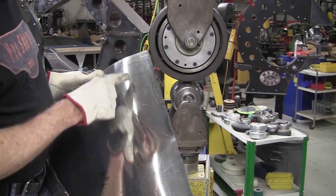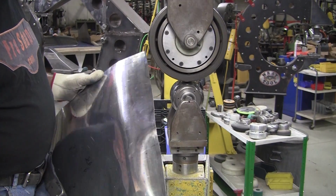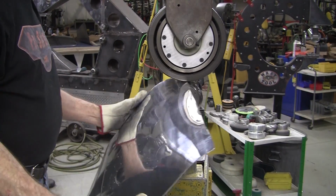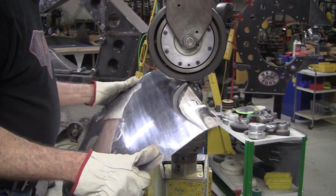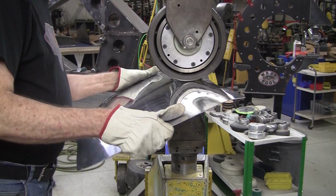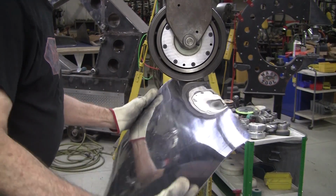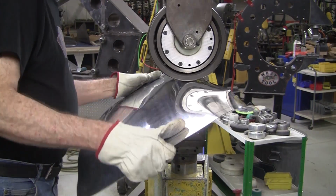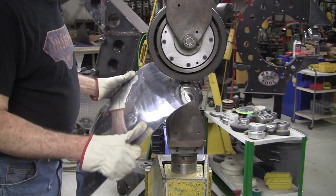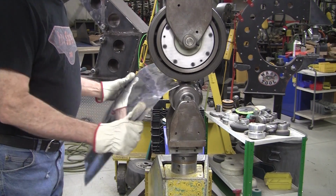Now later on, this flange has got to be tipped back the other way. We'll use the tipping wheel with that wood wheel that I think I used before that has the duct tape on it. That's a nice soft radius, and it'll work really nice. And then once this radius starts to go over, it really wants to go over. It's like you break its back.